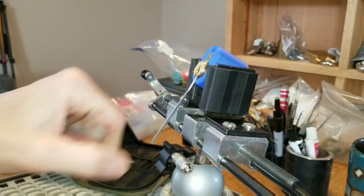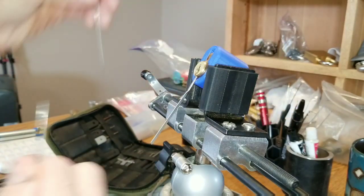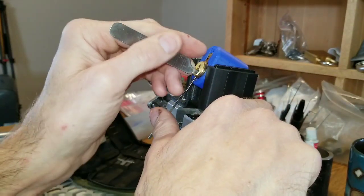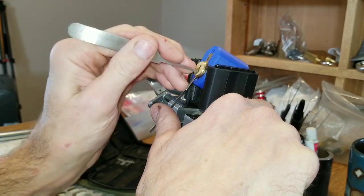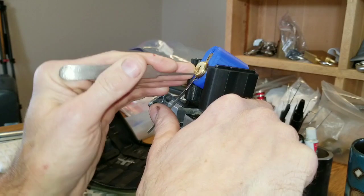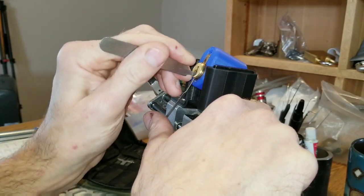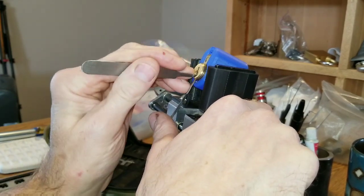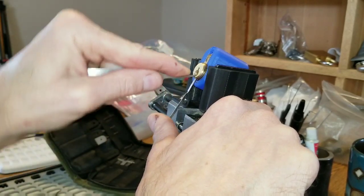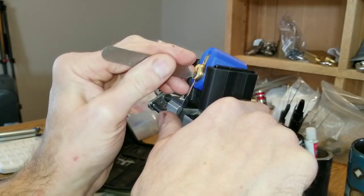I haven't picked on video with one of my homebrews in a very, very long time. I see all these beautiful picks you guys make and I really want to start making them myself. But I think I'm just going to make them for me, because I sent Jimmy Lovejoy some I did an experiment with and tried thermal cycling. Not knowing what the steel is, just knowing it's high carbon — that wasn't very smart. Picks are so thin it warped them, and his broke, mine broke. So I'm done thermal cycling. I might just buy some good 1095 stock and go from there. I've used it for 12 years making knives and I love it.